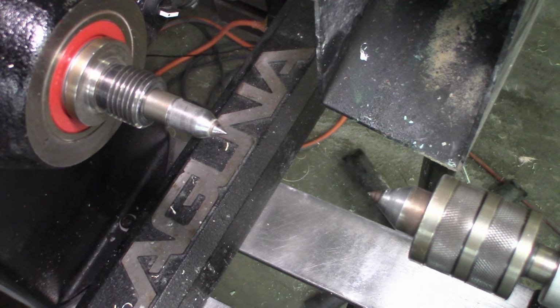Another thing that's going to happen with these really abrasive types of blanks, if you use barrel trimmers, it's going to destroy it right away. You're going to have to sharpen it immediately, possibly after the first one. I was able to get through both. I sanded it down, realistically, I think I even hit the brass a little bit on one of them, so I got it really close and then used my barrel trimmer, but I'm pretty sure that thing is going to need a sharpening already. So you might want to just go with the sanding method.